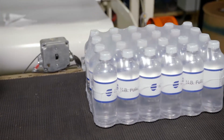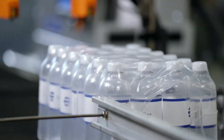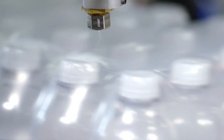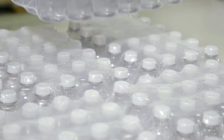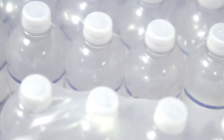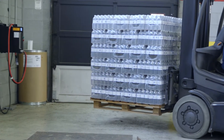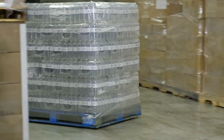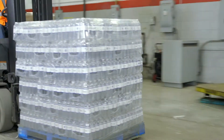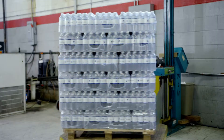Let's take a look at the process. As packaged bottles come down the conveyor belt, the equipment releases a bead of the heavy-duty adhesive on top of each shrink-wrapped bottle cap when packages move under the equipment. Packs of products are then stacked on top of one another on a pallet. When an HB Fuller palletization adhesive is applied to the top of packaging, the adhesive grips beverages into place and prevents pallet loads from shifting during merchandising and transit, reducing the need to use unrecyclable stretch wrap for stability.